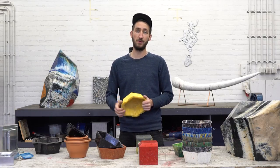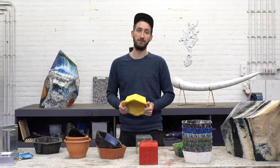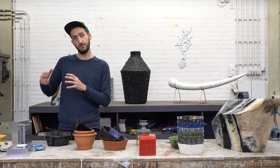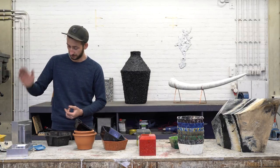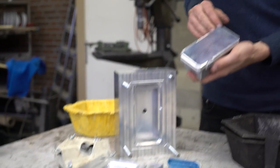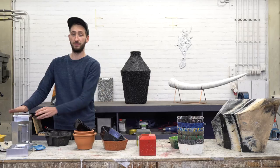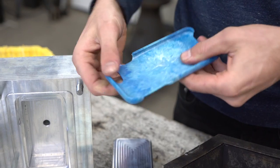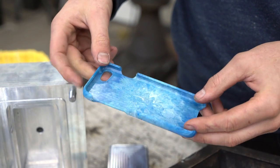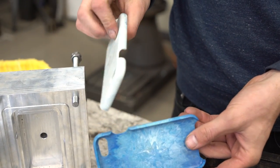I'll show you how to finish products up, using some stamps to mark each product to show which type of plastic it is. Overall the principle is: the smoother your mold, the smoother the output. For instance, here we have a CNC milled mold from aluminum that produces an iPhone case, and this one is super finished and super smooth. So the output product is also going to be super finished — you don't really have to do anything with it. It comes out of the mold and it's done.